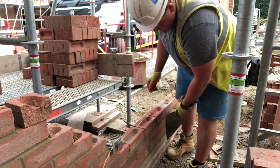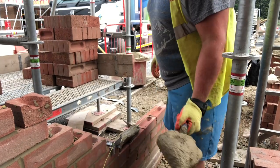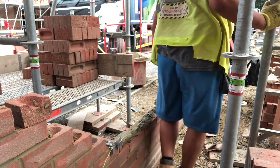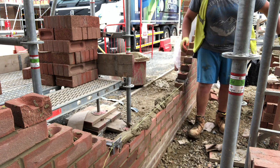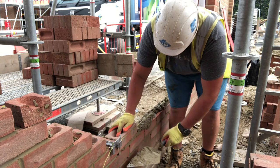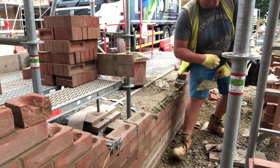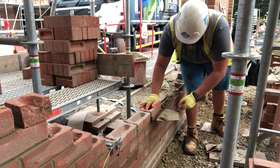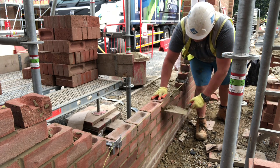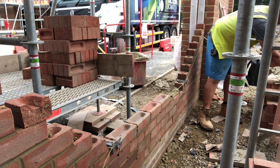Normally the driver could have boomed a pack right into the back garden, but he wasn't able to, so I had to get my bricks on the pavement. I needed to leave access to get my mortar in. So what I did was build two 12-course corners all the way up at each side, leaving the middle out so I could get to my mortar. Then I used a massive board full on each corner, filled those boards back up, and started running in the middle. I only had to carry about six or seven buckets round — I always carry two at once, so it was only two or three trips.